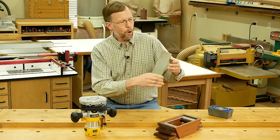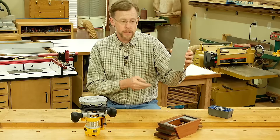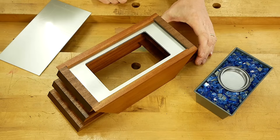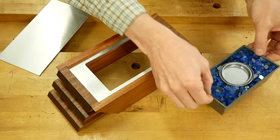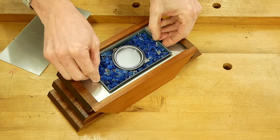I needed to cut a hole in the middle of an eighth-inch thick piece of plate aluminum like this to fit down inside the project. The aluminum helps to dissipate heat when the fire pit is lit, and the hole inside is sized for this little bread pan with the fuel source so it can fit down inside.